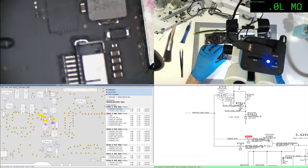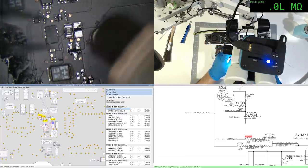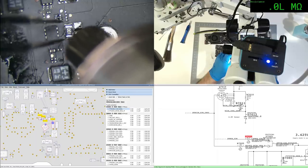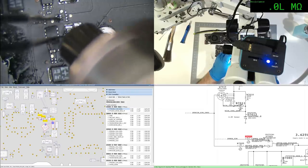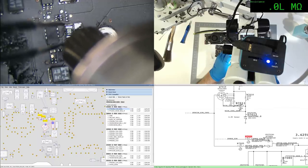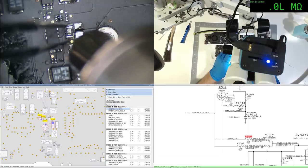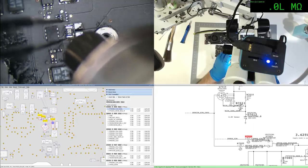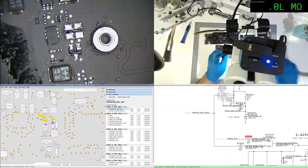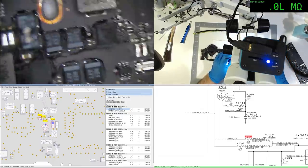Okay, to be fair, there's a few parts I didn't replace yet. So we'll steal this one. And I've already forgotten to put the solder down for the other, but we'll see how we go. Could have sworn that measured 10 before, but that's the trouble with measuring in circuit. You're measuring in parallel, so if there's anything remotely close to that, it'll drop it quite a bit.